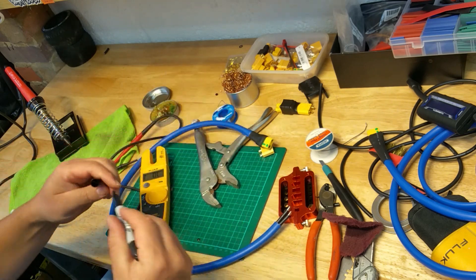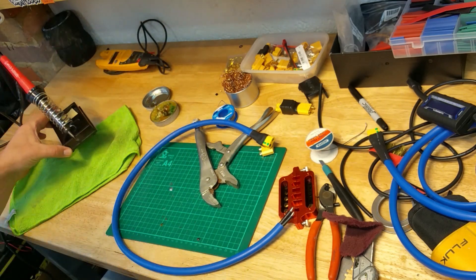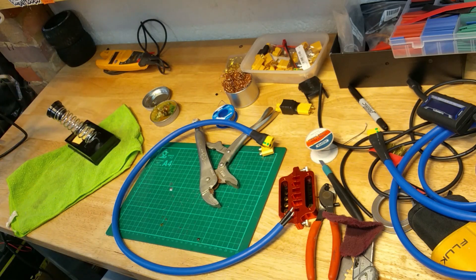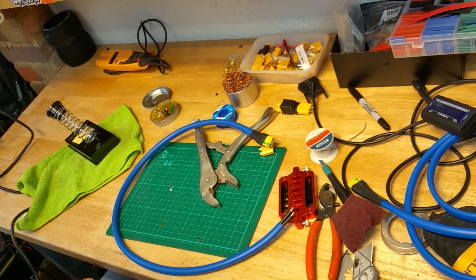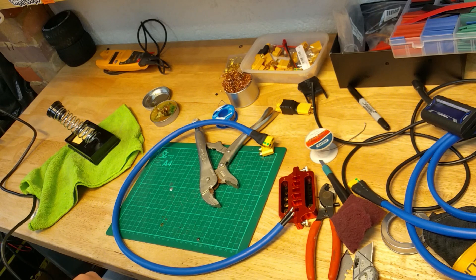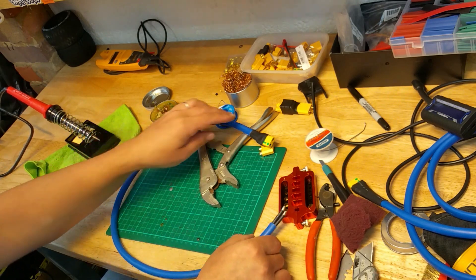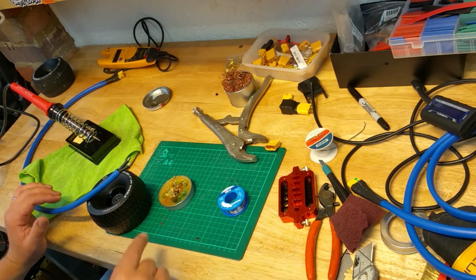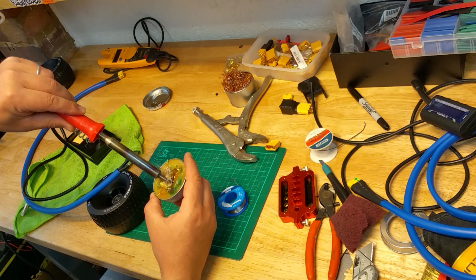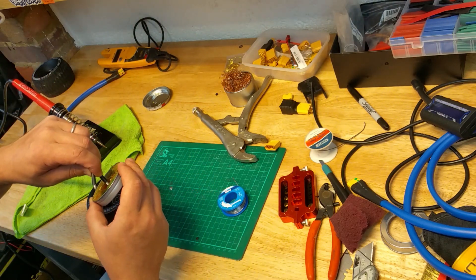This is because I've already done the first plug, so it just needs to match — otherwise you'll have a little boom, and I don't like electrical booms. The soldering iron is now smoking up nicely, getting that tip nice and clean. As soon as it starts smoking like that I use a wire brush and clean the tip off even further — again, you don't have to, you can just use a bit of sandpaper. Make sure the soldering iron tip is nice and clean. Now we're going to tin this tip: we need some solder and we need the flux, so I'm going to warm the flux up in a tin.